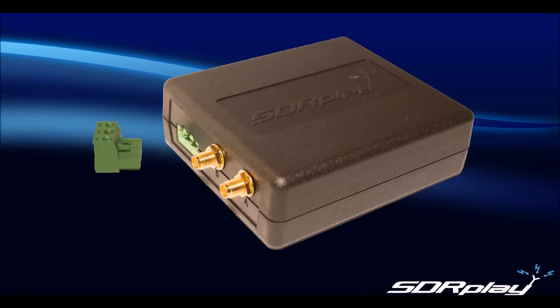As you can see, unlike the RSP1 which had just one RF port, the RSP2 contains three. The two right hand ports are general 50 ohm RF ports which operate from 1.5 MHz to 2 GHz. 2 GHz is a hard upper limit as the unit will not function above 2 GHz. Whilst 1.5 MHz is not a hard lower limit, it is the lowest frequency that we recommend using these ports and the lowest frequency for which these ports are specified. Using these ports below 1.5 MHz will most likely result in degraded performance.